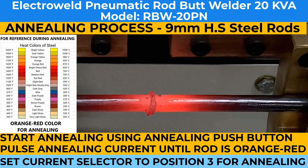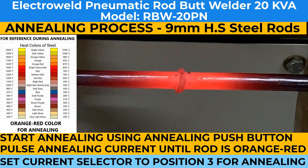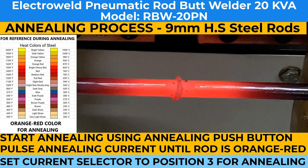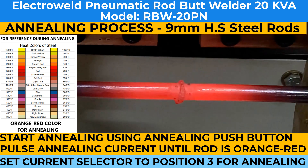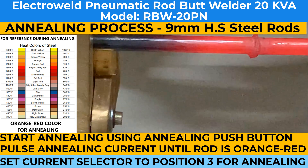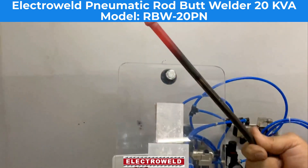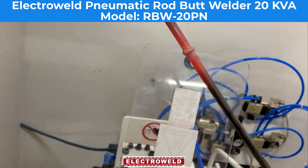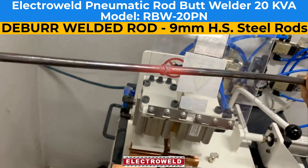You should heat up slowly until a reddish tinge appears and the scale is visible near the welded joint. This joint, if annealed properly, will not break in the dies. Now you can declamp the welded joint. Just see the quality of the weld — it is homogeneously welded, and you can see all around that this weld will easily pass through the dies.